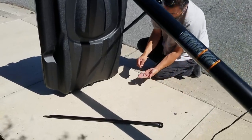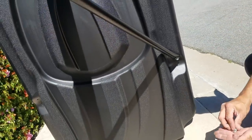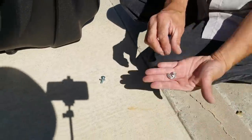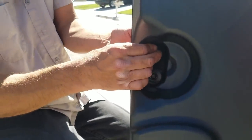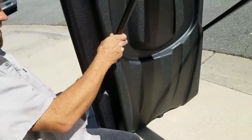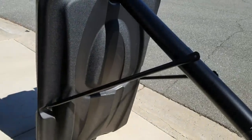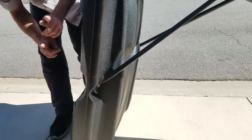The flat part connects to the base; the other end of that pole has a little bit of an angled bend — that's the part that connects to the pole. Right up against the pole is the little angled side. After you put the washer and the bolt through those holes, there's a washer and a nut that goes on the back side — I just hand-tighten it, washer first. I'll come back later and tighten these. The other side goes on the same way. I pop it through, swing it, and lean it against the pole — it kind of holds itself. Then I put a washer and nut on the other side, just finger-tighten it. And we're moving right along.